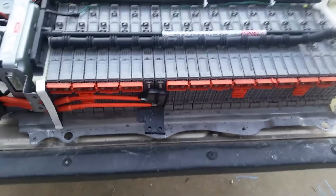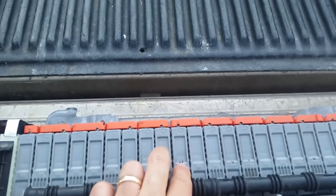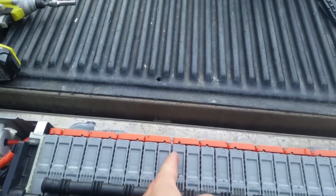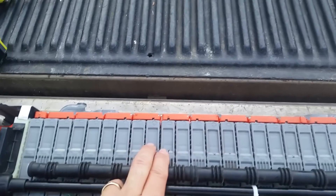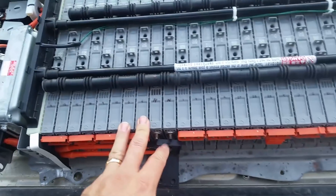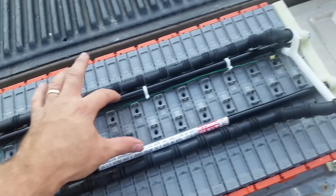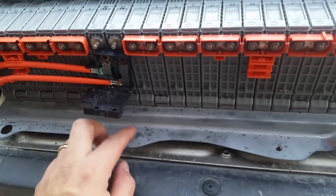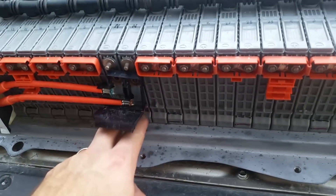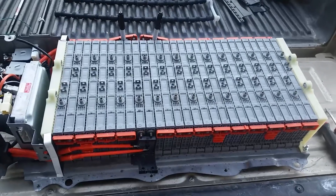I pulled this battery out and these two cells are bad. I've tried cycling them and they will not hold much more of a charge. You can see there's a bit of a spread — these are bloated up. What I'm gonna do is take the holder bars off of here. My attempt is to take the 8mm bolts off that hold it underneath and get under here with a flathead to see if I can pry these cells up without disassembling the whole pack. I've got the bars off.